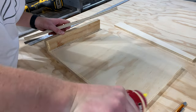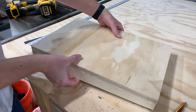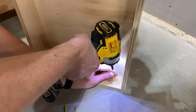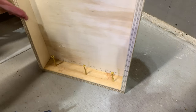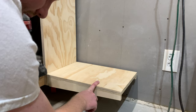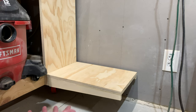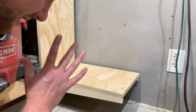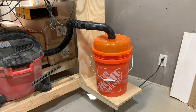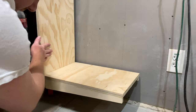To assemble this I just used some wood glue and some brad nails and it was good to go. Now I've got the shelf made up, I'm going to start some screws in here and lift it into place. Looking at this shelf I realize it's very close to the ground and I probably could have gotten away with just setting the bucket right on the ground. But I still wanted this whole assembly attached to the table so that if I move the table in the future, this whole assembly moves with it.